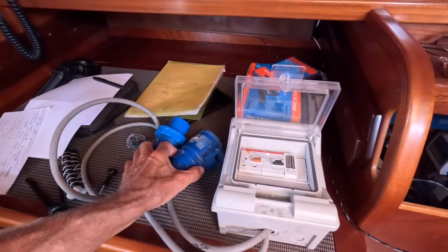Everybody seems to know about GFI. In almost all the boats that came out after 1999, when this boat was made, they all have GFI interrupters, breakers, and all that. But some of the newer technology is arc fault detectors. Arc fault detectors will detect an arc in the line, whether it be the high or the low. If there's any type of arc, it's going to shut down that power. I always have an arc fault between the shore power and Aquarius, so the whole boat is protected — any power coming in, if there's an arc in the boat, it's going to shut it down. So it actually tests the boat and at the same time protects it. That's my device that I put in between shore power and Aquarius.